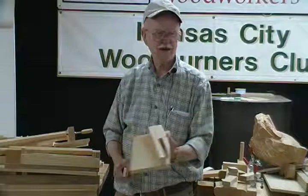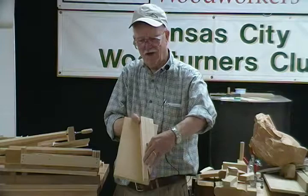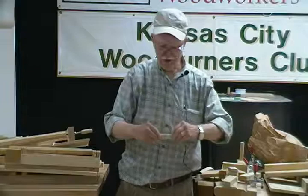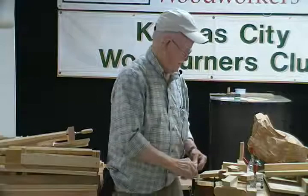If you look at the picture on the right — it's this jig. If you put that piece in there, I have established my cut line on the saw. I now have an angled fence, a stop block, and a guide on the saw. I can cut these all day long. Then I can go to my table saw, position this, and cut it into two pieces like this. Now I've got two little scraper bodies. Go over to the sander, smooth it up, round the thing off, put a blade in it, and I've got a handy little scraper.